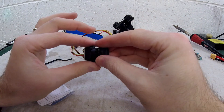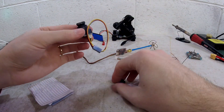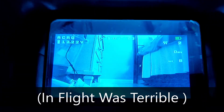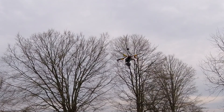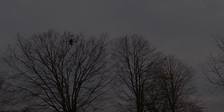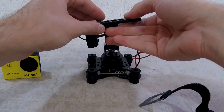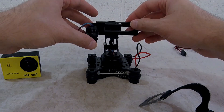Three, the initial FPV camera didn't have a wide enough field of view and was difficult to pilot. Speaking of FPV, the video most times was terrible. The mixture of vibration, a bad PID tune, and electromagnetic interference made it nearly impossible to use. I also learned the importance of using threadlocker. Vibrations led me to lose several screws which then needed to be replaced, particularly in the gimbal.